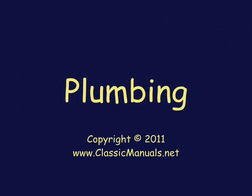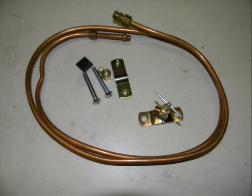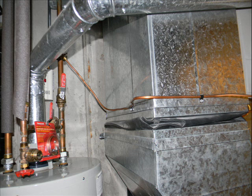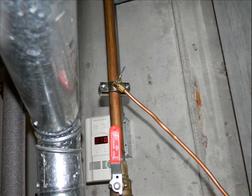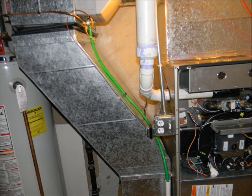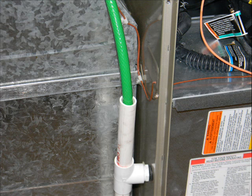Actual plumbing is the next step. I used quarter inch copper tubing — don't use plastic tubing — and a saddle valve that came with the humidifier. I also remounted some of the wiring on the solenoid valve. There's the routing of my quarter inch copper tubing. You can see the saddle valve — here's a close up. Turn the water on and make sure you don't get any drips. Here's a close up of the water connection into the solenoid valve with the wires hanging loose. The next thing I did was the drain hose — I used half inch garden hose into my furnace drain, making sure the air gap is still intact.